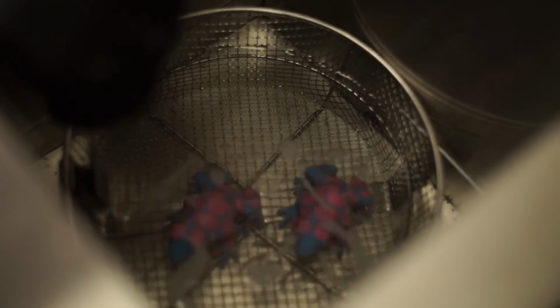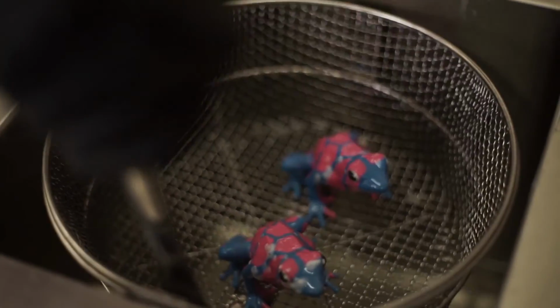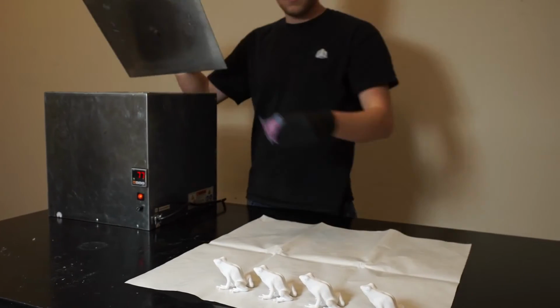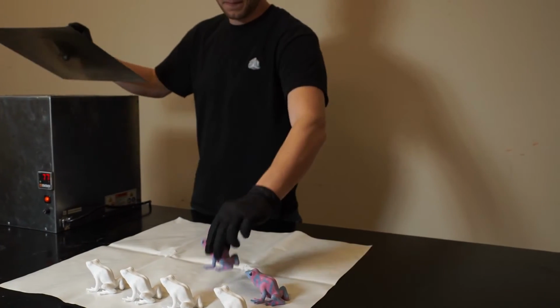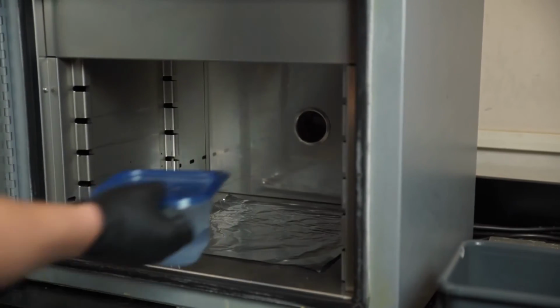This happens because the wax is infiltrating your part, pushing all the air in it out. It remains submerged in the wax until no more bubbles form. Now raise your parts from the wax and let them sit at the top to drip dry for a few minutes. If you don't have a waxing oven, use a Tupperware container and the ProJet Finisher ovens from earlier.